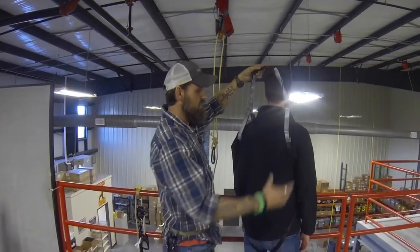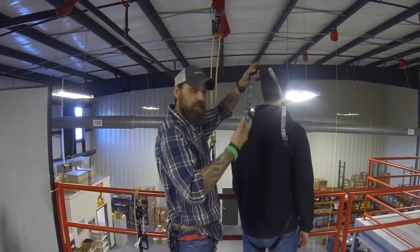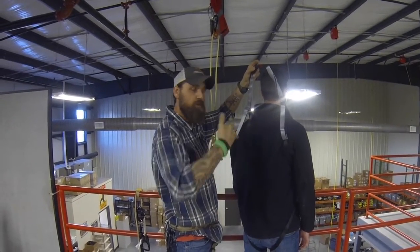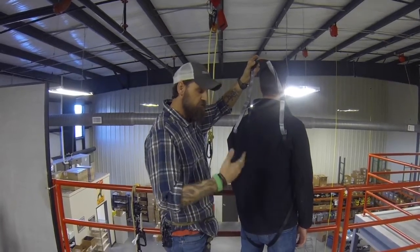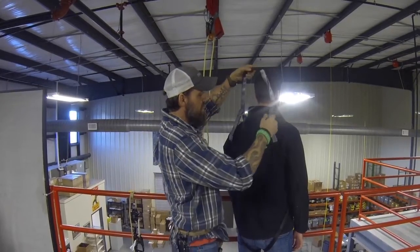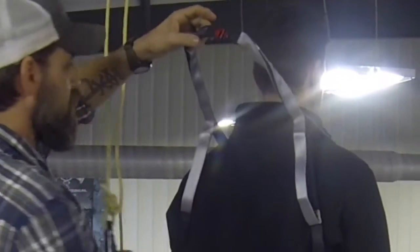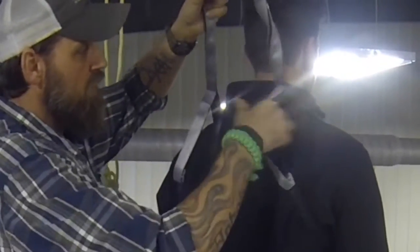Now we're looking at the ERS for doing a vertical movement — lowering or hauling them up. This can be put on somebody before they're placed on a litter or something like a Foxtrot, and then whatever you put them on becomes hoistable because we're hoisting off something rated for a class three versus any piece of the litter. We want to make sure we clip into anything with black involved — the black is what has the reinforced stitching for vertical movement, not just the gray.